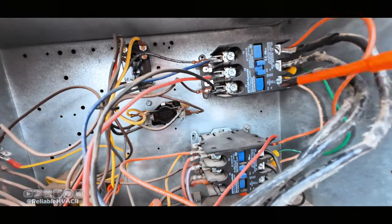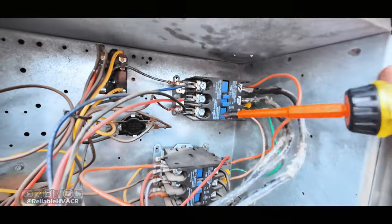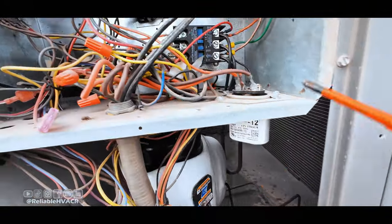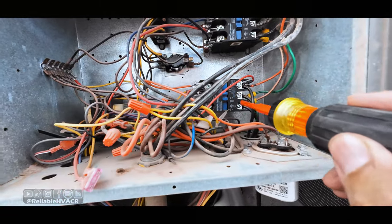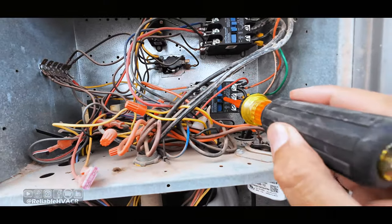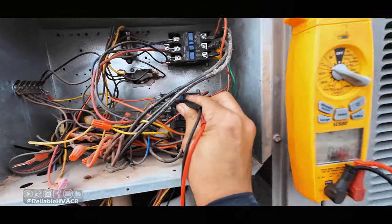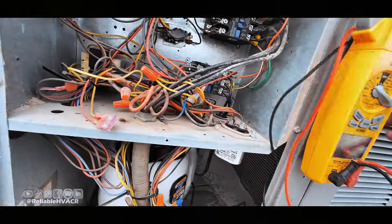If you guys can see — it got cut off in the video — this is a good contact; you can press it in. This one never shut off basically because we still had power coming through. I turned this back on and the condenser fan tried to run. I'm assuming only some of the contacts are making a connection, so it's probably single phasing. That one is open, that one is welded shut, and that one's welded shut — so two of them are making contact and this one's not. Let me go get the replacement; I'm pretty sure I just restocked.